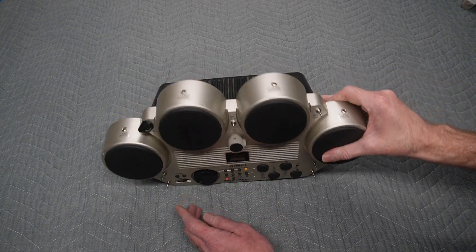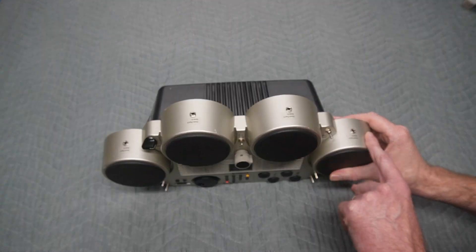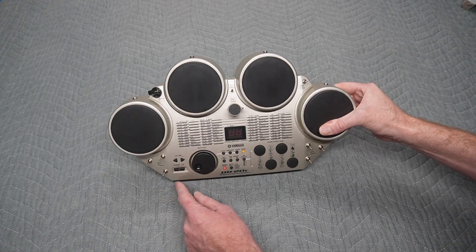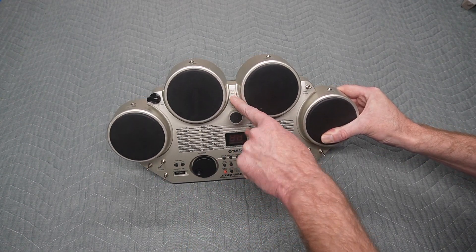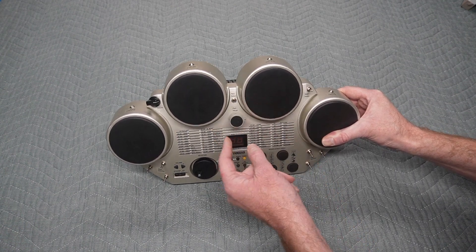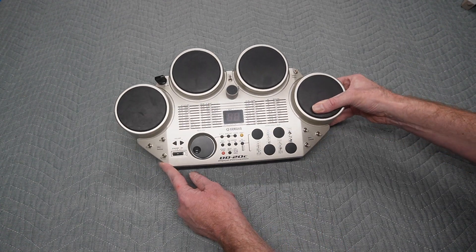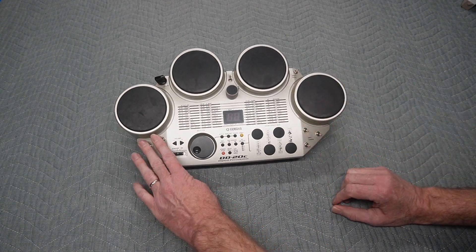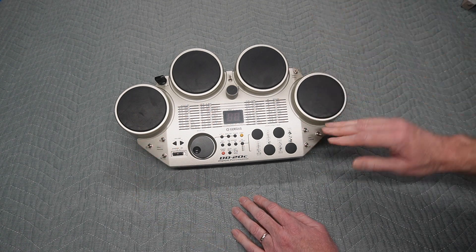The modifications I have done include a gate input to all four of the drum pads, a pitch adjust section with a pitch select — in the down position it's the normal stock timing and then in the up position it's variable with this knob, and then seven different glitch switches: three over here, three over here, and then the final one up here that affect the sound.